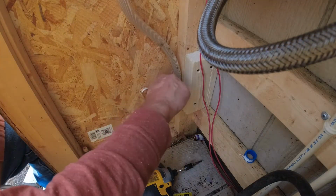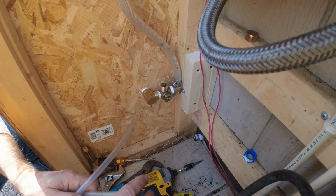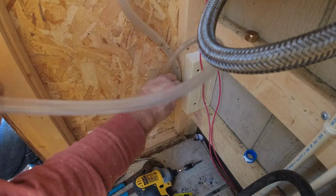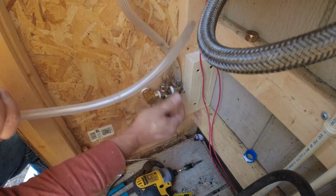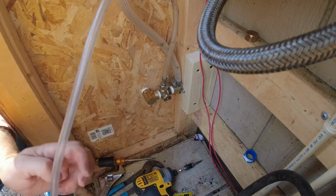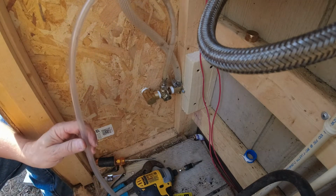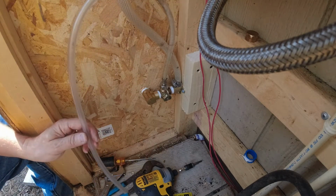Okay, so now, whenever you're gonna winterize the cabin, just take that cap off and add this hose. Flip the valve to like that and drop the end of this tube down into the jug of RV antifreeze. Run your spigots until they turn pink. That'll take care of it.